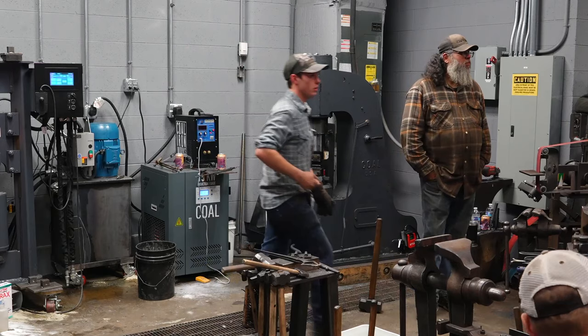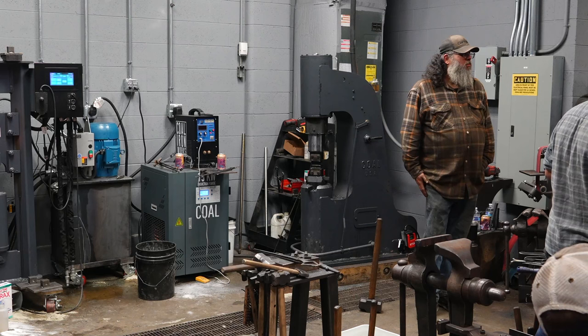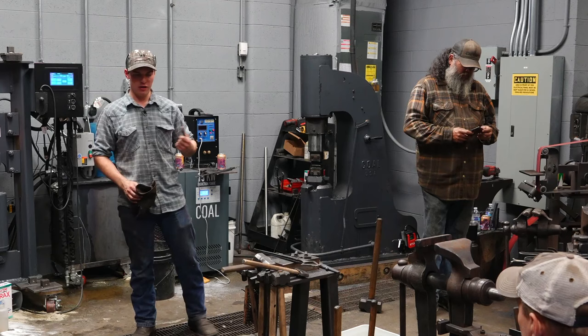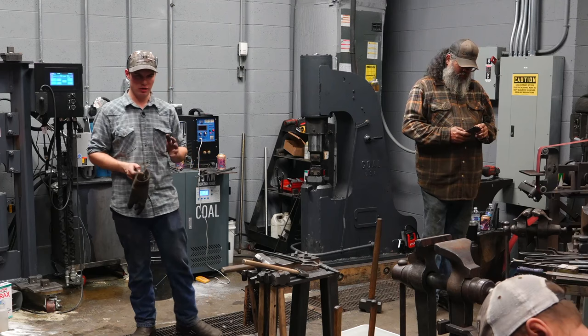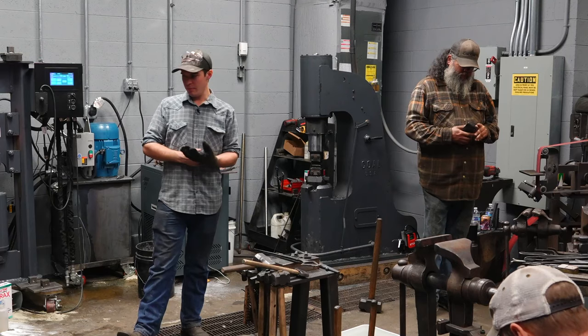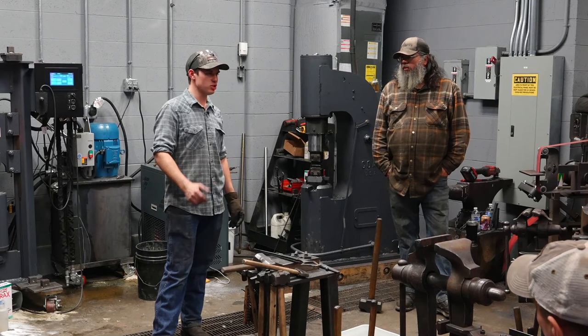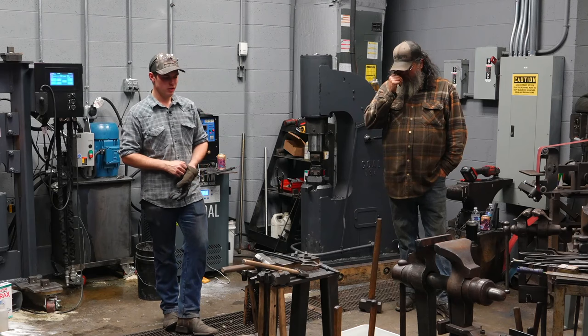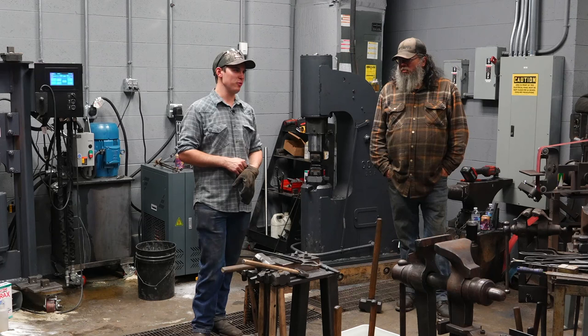Sorry? With the hardened coating or with the surface hardening, can you forge that? Yes. So some hydraulic shafts are surface hardened. The very surface of it has been induction hardened. If that's the case, we stick them in a forge and bring them up to dull red, let them cool off, and then the bandsaw will cut them. It's a simple mid-carbon 10 series steel. You can really manipulate it a lot by doing different things. We often joke that you could chill 1045 and drop it in water and it'll harden, but it's pretty simple.